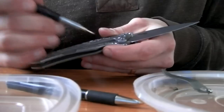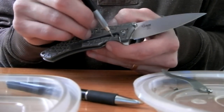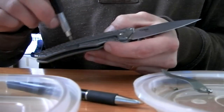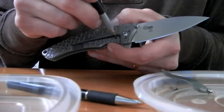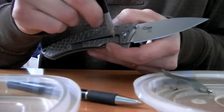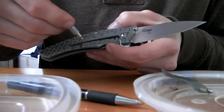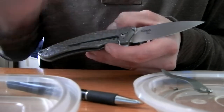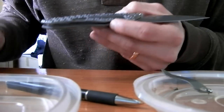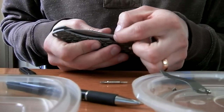I can only imagine that he got these water jet first, and then machined this first, got the lock bar cutout water jet, and this is just a way that he can bolt it down to the fixture and put this nice chamfer to break the corner of all this. So that just keeps the lock bar from buzzing around while he's machining it. Pretty smart.